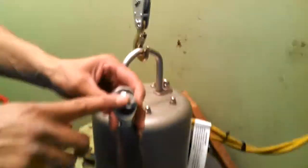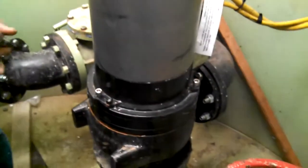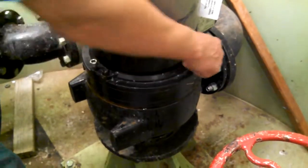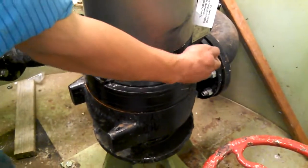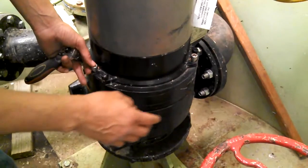We've got our 8mm Allen wrench head, with a socket drive to remove 3 bolts — one on each side. You've got bolts on the right which we don't touch; we remove the bolts on the left. They were already removed prior to the video to save time.